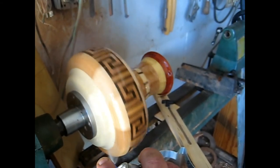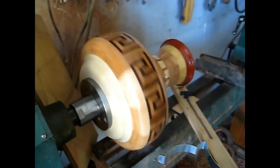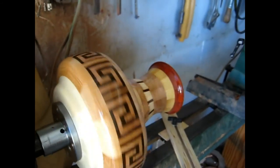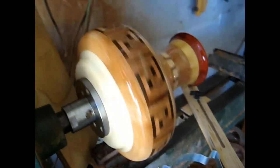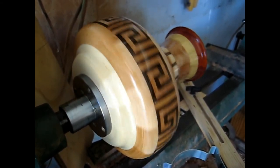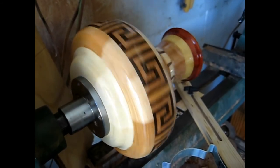And the motor — I put in a motor from one of those exercise mills, and that way I can turn it all the way down. The original motor was about two-thirds horsepower, and this one is two and a half horsepower, so it's a big difference. And it doesn't bog down every time I try to make a thicker cut.